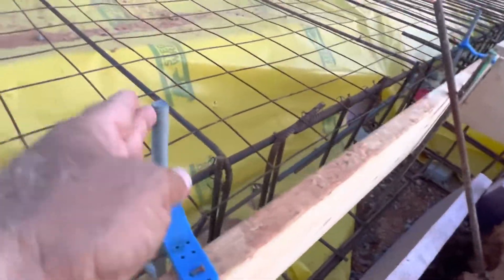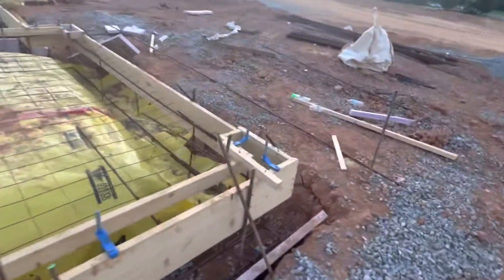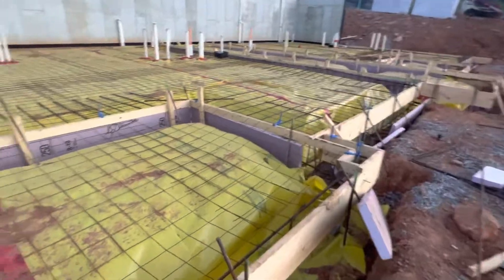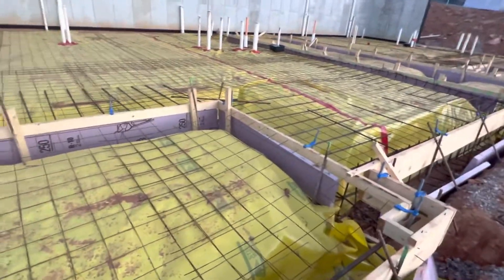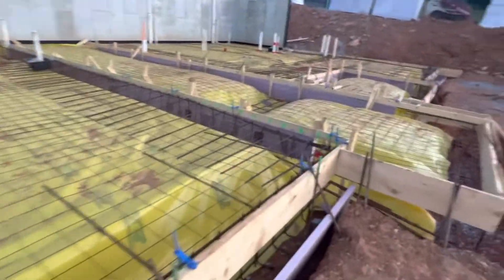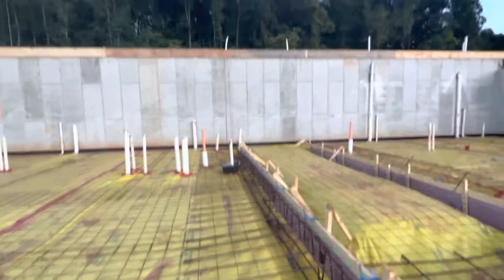That is a thread bolt used as an anchor bolt for framing — it is like a J-bolt. You can see how they support it: at the corner we have two, and there are two at the door opening as well. The plastic sheet minimum is 10 mil, but here they used 15 mil, which is better. You can see the dowel placement depends on the structural design, and that is the retaining wall.